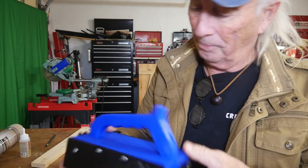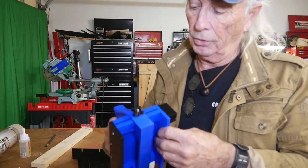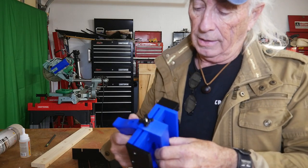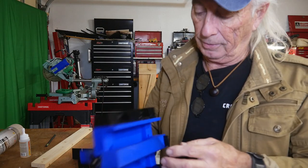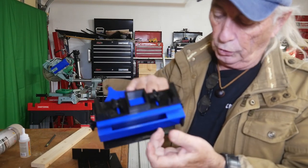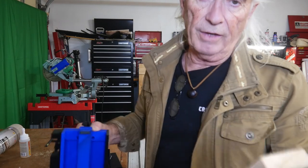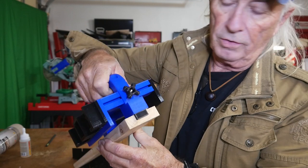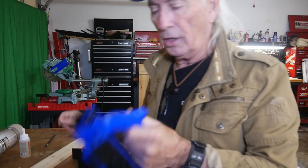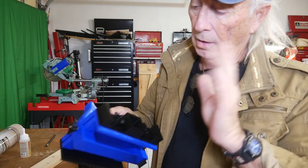Thumbs up to whoever came up with this design. I'm going to provide a link in the description so you can pick up the 11 STL files from Thingiverse and make yourself one of these push blocks. One thing to mention: this little piece in the back — if you had really thin lumber you could catch your table saw with it and maybe even break it off. I also noticed that if you try to start off the table you tend to lift your lumber, so you're better off starting on top of the table where this thing won't get hung up. Check your blade clearance and just enjoy the product — this is one of the coolest things I've made.